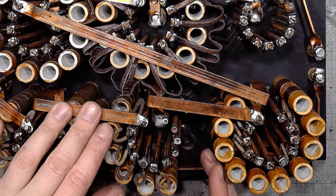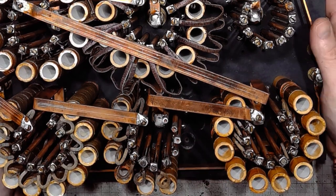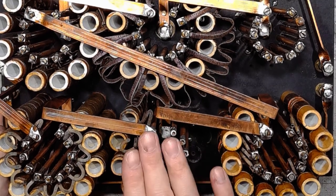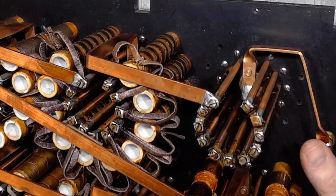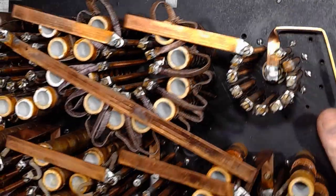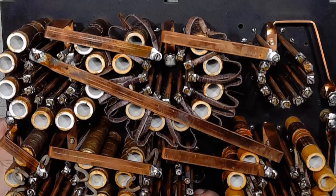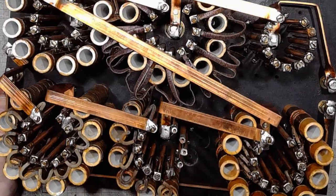And looking at the resistors that have been removed, I've got some bad news. The kilo ohms range is not gonna work, and I will have to fix it with 1 kilo ohm, preferably 5 watt resistors. Almost breaks my heart to see it.